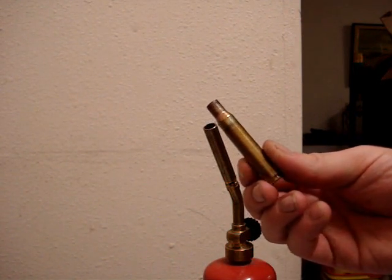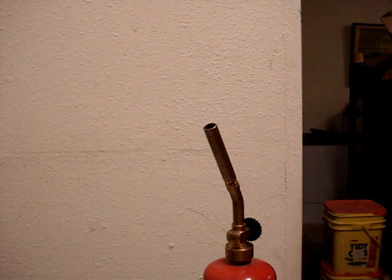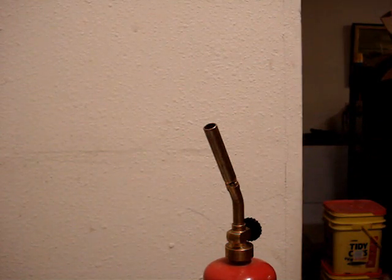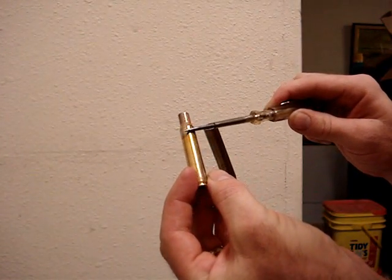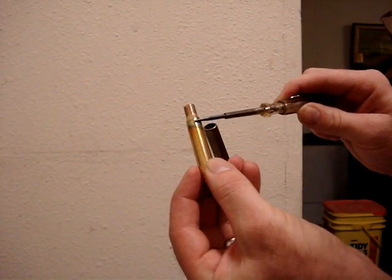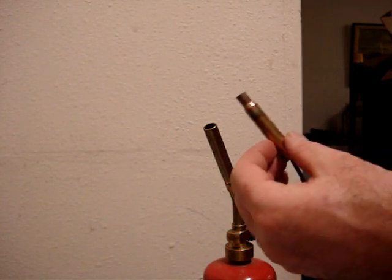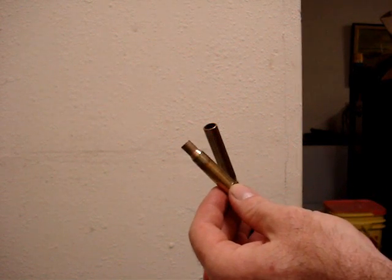See that color? That's a pretty decent color. That's another one that's fired — it's a little darker and the reason is that brass is kind of old. Very old brass will need to be annealed. You see how through here it kind of goes up and down — that's fine, it's no big deal. This could have been taken care of by using the drill, but I couldn't narrate this with the drill noise in the background. So what you got is a nice little case now that's ready to be manipulated through swaging in several different dies that we're going to end up using.